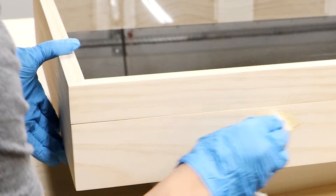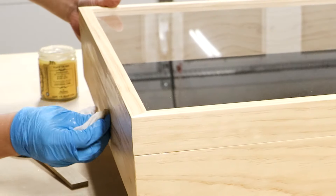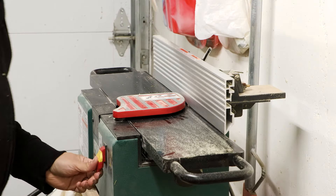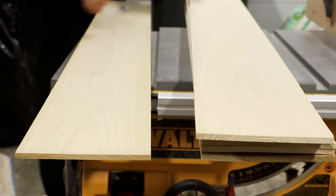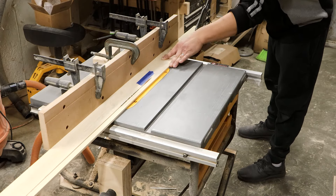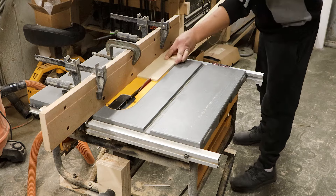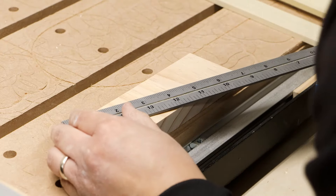With all the prep work done, I'm working my way up to 400 grit. For my finish I'm using Odie's Oil. Since this is going to be my first new product in my collection, I wanted a matte sheen. After a lot of research, I settled on this because of how well it brings out the natural color of the wood without discoloring the grain too much, and I wanted to only base-coat the exterior.